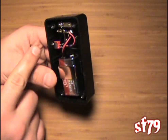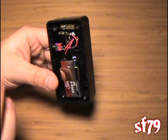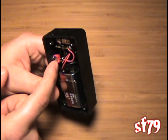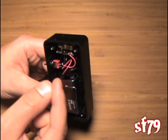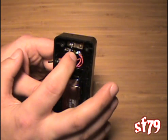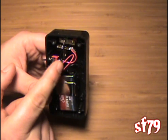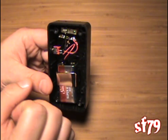This is our toggle switch, and the way this works: when you take your 9-volt adapter — obviously you don't want to do this while it's connected — you're going to run the positive of it to one side of the toggle, and then from the other side of the toggle another wire comes out and goes to the corresponding positive part on your transistors. As you can see, I have both of the transistors up here, with the positive and the negative, and they're both running off of a single battery.